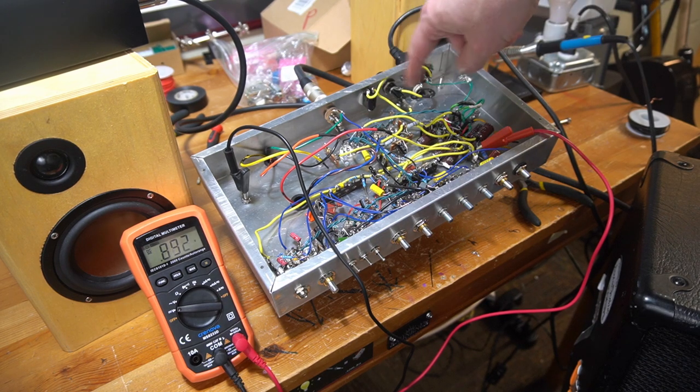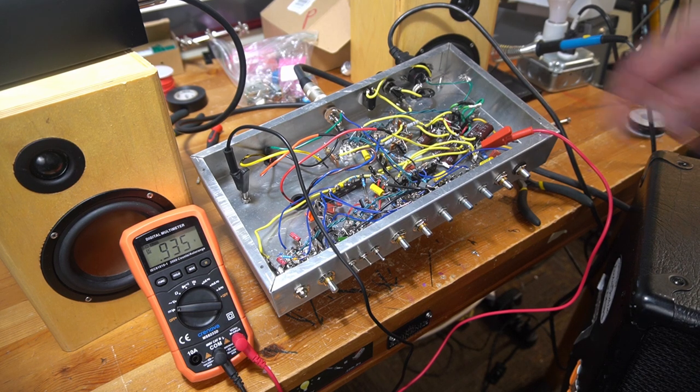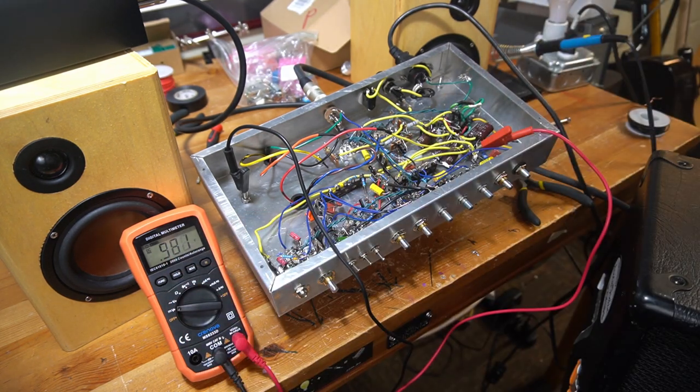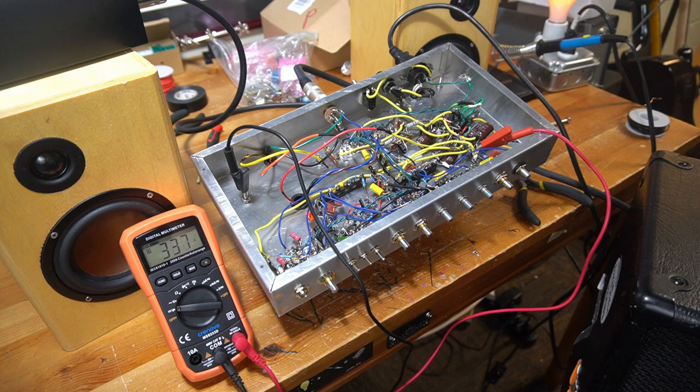Okay, I got my output transformer wires flipped around, so that should defeat the positive feedback problem. I'm still monitoring my B plus 5 node for DC volts on the plate. I guess that's gonna feed the B plus node, which will feed the plates. And I have a speaker plugged in. YOLO? I think I want to hear something out of the speaker.